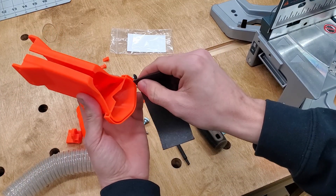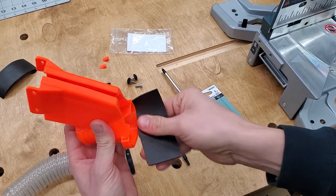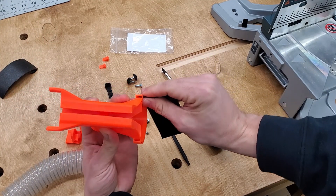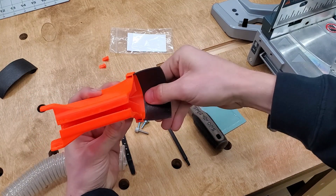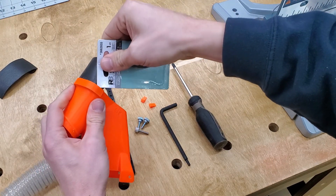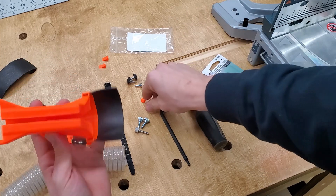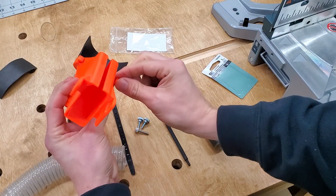This is a one-way track — it's got some geometry in it that prevents the rubber from slipping out, but it can come out from time to time. You just kind of start on one end and slip it in, push it all the way back, and work it in along there. Most of the time you can shove it back in by hand, but I like to take a guide and make sure it's fully seated in the back of the track. It holds best whenever it's nice and square and all the way seated. Then these wedges just push down inside and clamp the corners of that drawer liner in there.